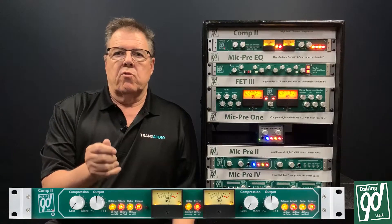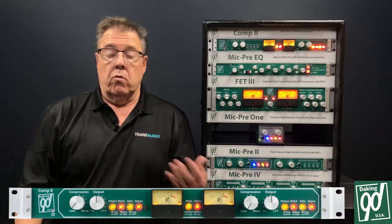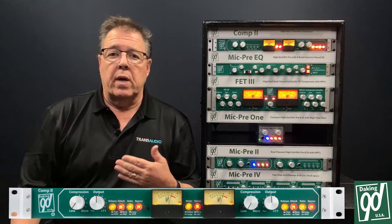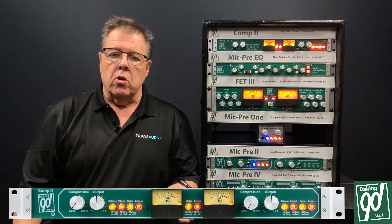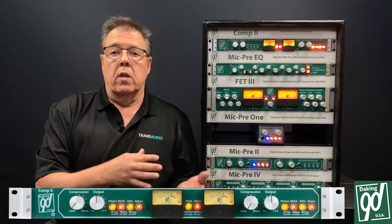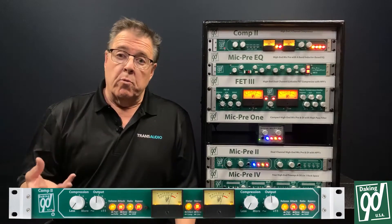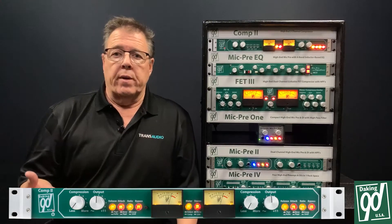The next feature is adjustable ratio. That's important because compressors need lower ratios — for vocals, you might use a fairly low ratio. But when you're worried about clipping the input channel, your mic pre, or your monitors, you need a much higher ratio. A compressor is generally below 10 to 1 and a limiter is generally above 10 to 1 — so for a 10 dB input level, you only get 1 dB out. By using it in limiter mode, you can protect your gear and prevent things from overloading a channel or becoming too loud in a mix.